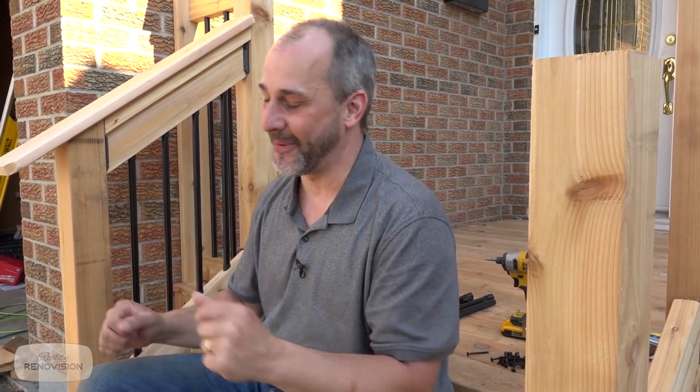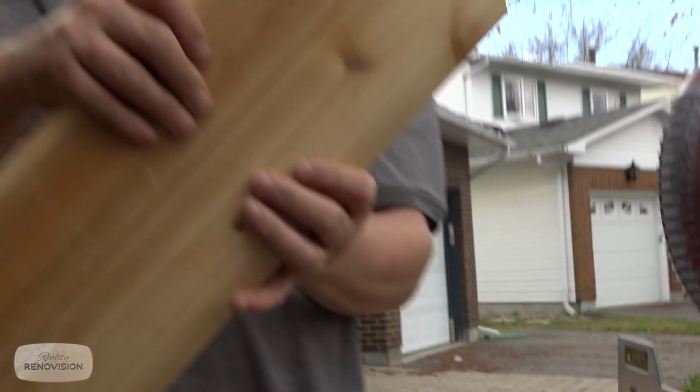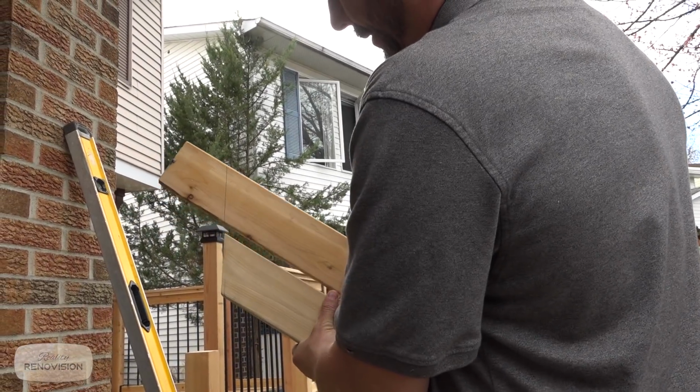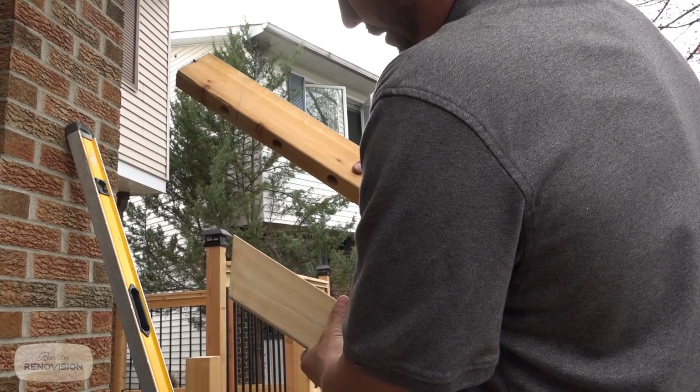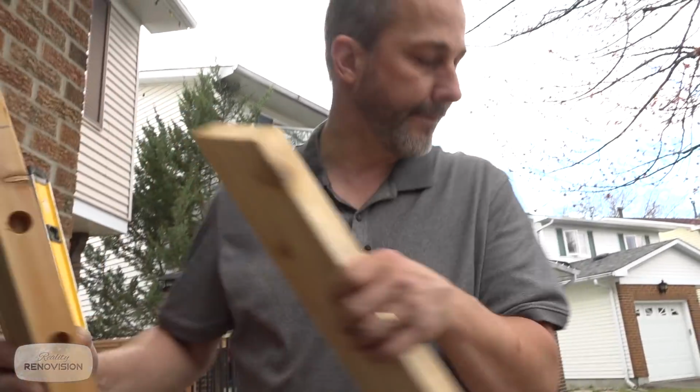What we're going to do right now is demonstrate a simple railing system that is attractive and forgiving, which is important. And you can see that it'll actually make some sense. So that's where it goes. Okay, you see how my line is perpendicular? If I was to lift that straight up in the air, that hole will be directly above that hole. The gap remains constant.